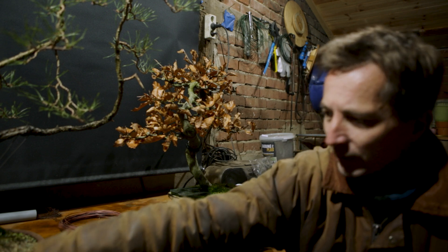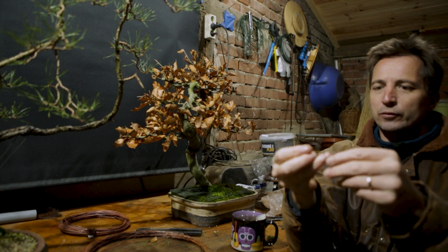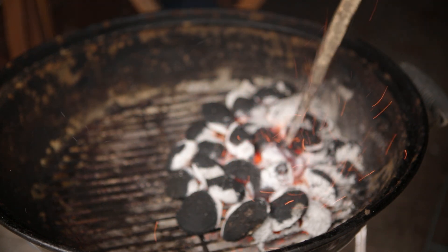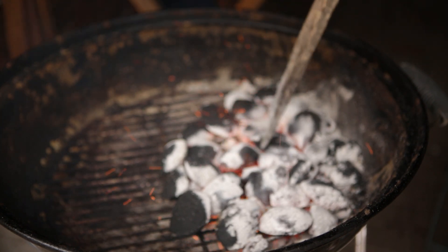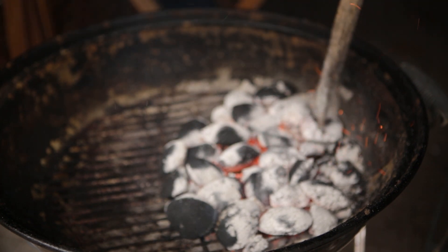One thing to keep in mind: you want to be able to bring it out again. I can hook it out with a hook rather than with my bare hands because it is going to be glowing hot. I want a good glow on all of the coals before I put it on — it really needs to be nice and hot. If you do this, make sure you have a place where you can put the wire to cool down. Make sure you have a metal hook to lift it out, and don't touch the wire against anything because it's going to cool down very slowly — it's going to take half an hour to an hour to become cool enough to handle again.